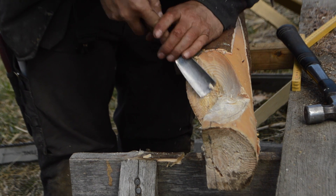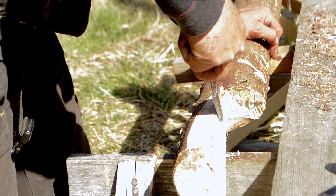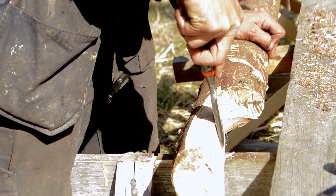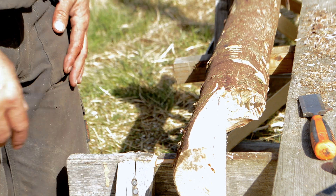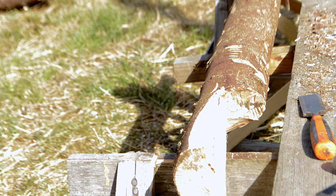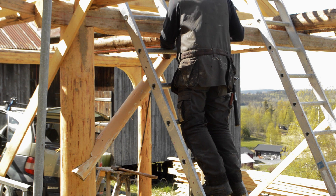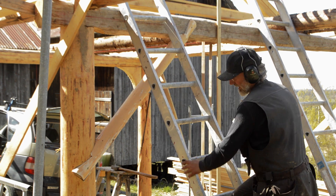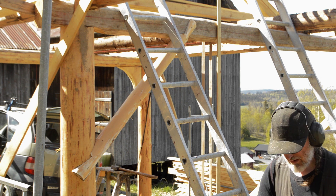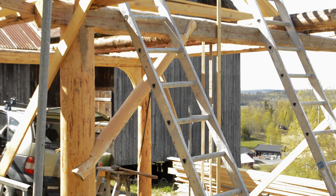But really this fresh timber is pretty soft. I'm not going to do any more on that now because that's probably much better and really it's going to change quite a lot — it's going to shrink. So I'm going to leave a little bit rather than do any dirt work. I think I'm just going to use like 20 millimetre, even maybe less — about 20 millimetres perhaps. The pegs — they're just going to be small but I'll make them out of ash. 20 millimetres, maybe just 16 actually would be enough.